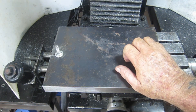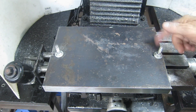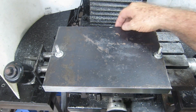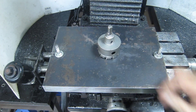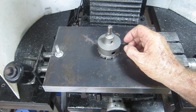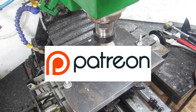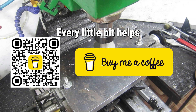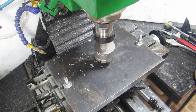It's taken the better part of three days to knock this over. After cutting that back edge off this morning and having to flip it, I kind of stuffed up the short part and had to flip it and remachine it. But it's all done with the two slots. Next cab off the rank is to find the center and get this through it, then finish it off with a boring bar so that the little boss I left on the base plate will locate in it. I'd like to take this opportunity to thank my patrons - their support is greatly appreciated. If you'd like to become a patron, there's a link in the description, or you can use Buy Me a Coffee or the Thanks button.